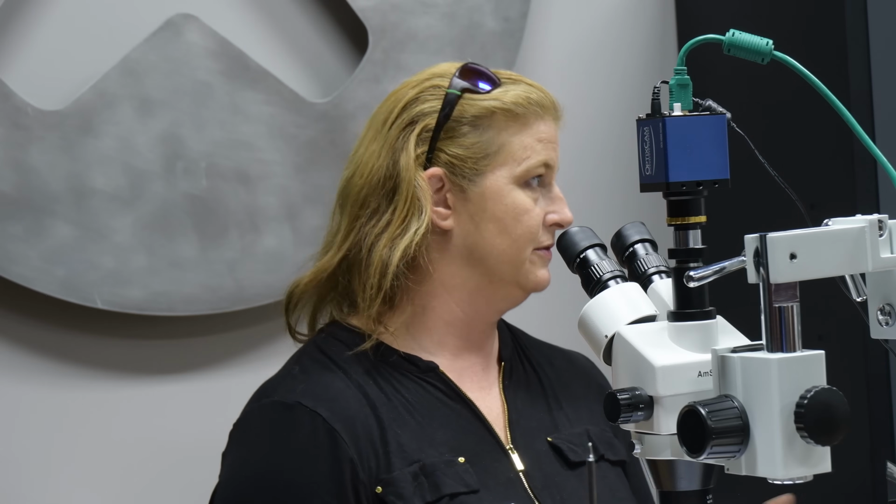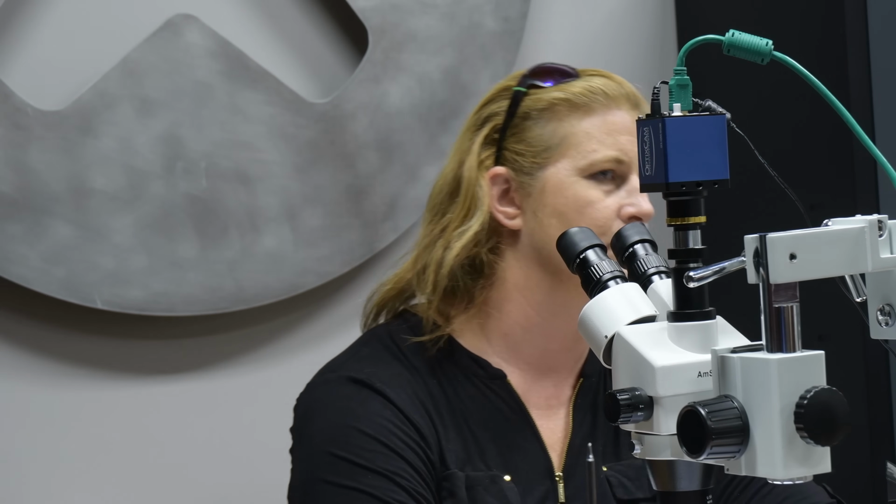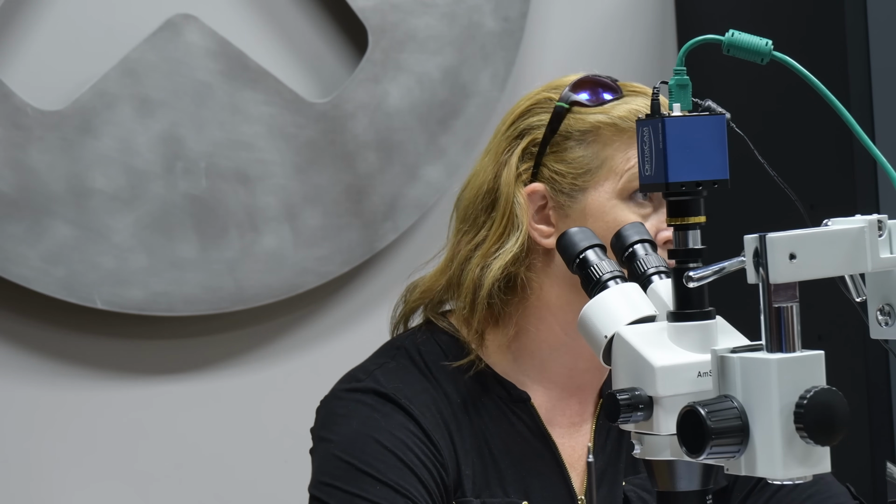These two caps here are on a line that, if we looked up in the schematic by looking at the board view and saying, oh, that guy's name is C2020, and asked the schematic to tell me about C2020, it would tell us the name of the circuit C2020 is on, and it would be PP_GPU. Now let's try to guess. What kind of a thing is that? PP, power of the GPU. Sounds pretty important. Power of the GPU.